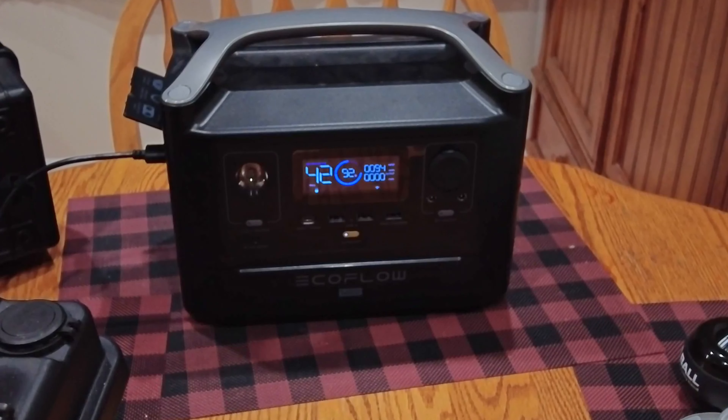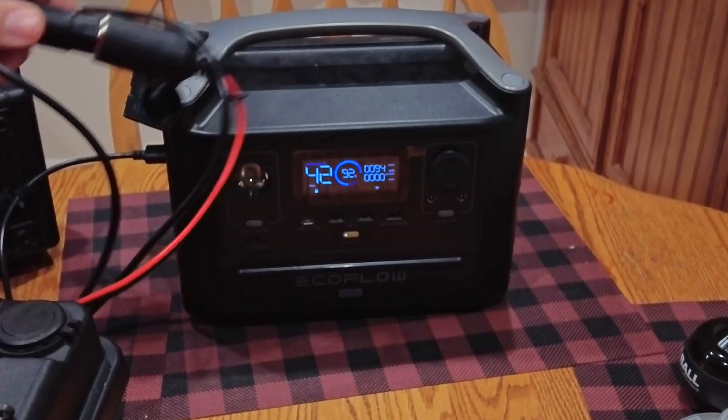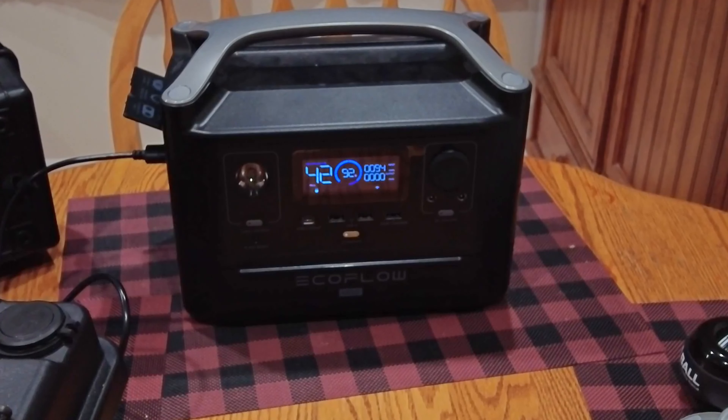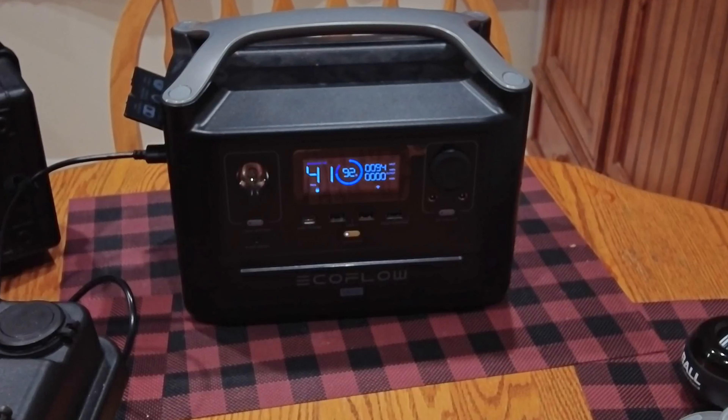Some people call these solar generators — I hate that term — but yeah, like a battery backup: as long as it's got a way to accept 12-volt input from a cigarette lighter, if you have amateur radio equipment you probably have batteries like this. You can either get a 12-volt to PowerPole adapter or you may just have 12-volt on your battery box. In a pinch, if you didn't need the radio and instead needed a little more power to the fridge or freezer, there you go. I originally saw this idea on another YouTuber's channel — I don't remember who, sorry — if you see this, let me know so I can give you credit. That's pretty cool guys, thanks for stopping by.